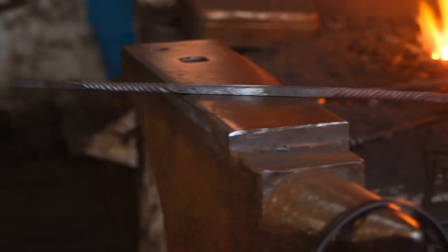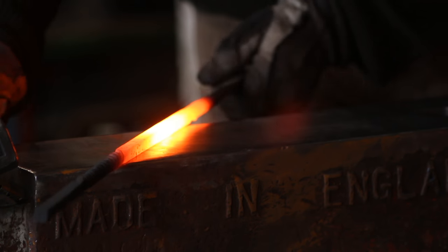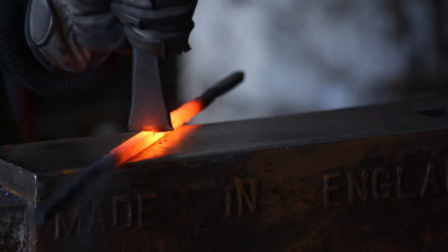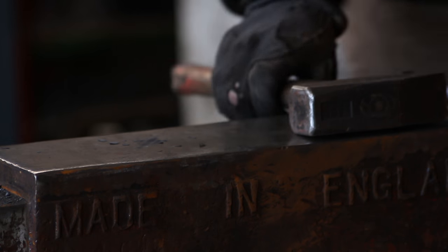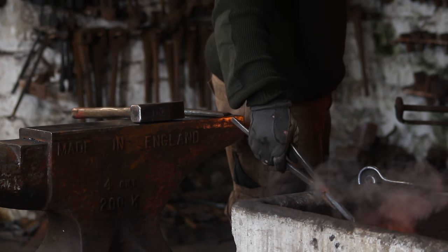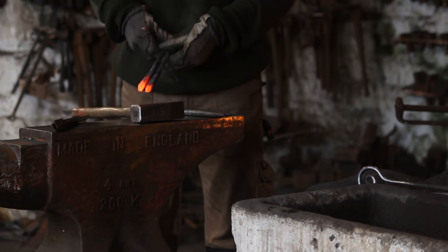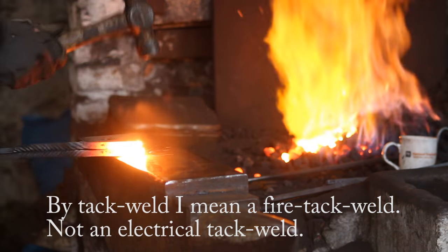So here's the bar twisted in two areas. At this stage you want to go to that centre mark and go in with a chisel slightly sharper than your blunt chisel or fuller that you used previously. You want to cut about halfway through the bar and that will help it bend exactly where you want it to. So to bend it, cool it off both sides and it will allow you to do this bit by hand which is a bit easier than faffing around with tongs. Now this is crappy wrought iron - I was hoping it would bend but as you can see it just split on me, which is not a problem. We will just tack weld it together and pretend like it never happened.